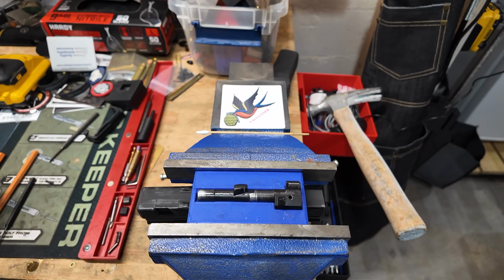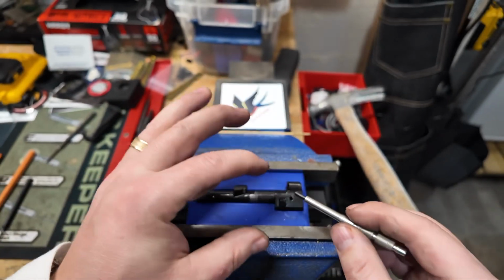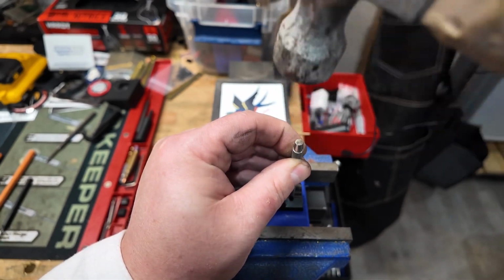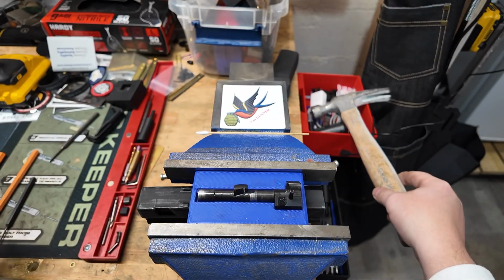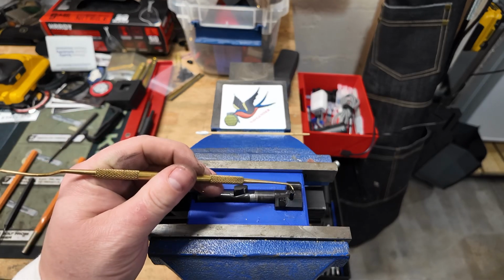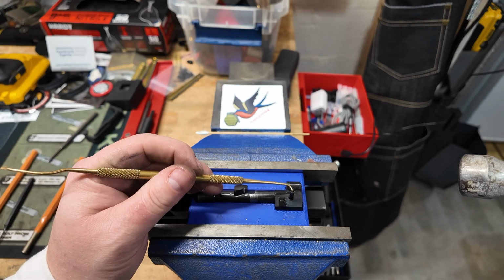Now, starting with the big roll pin, and on the diagram, I believe that is number 444, we're going to set the roll pin inside of the bolt, okay, and get it started. Okay, it's just barely started. Now, if your stuff wasn't lubricated, you would want to pre-do that. Mine's already lubricated, so I feel like I'm pretty good. And as I'm doing this, I'm checking to make sure that that slit is facing away from me in this orientation. That's the way you're going to want it.